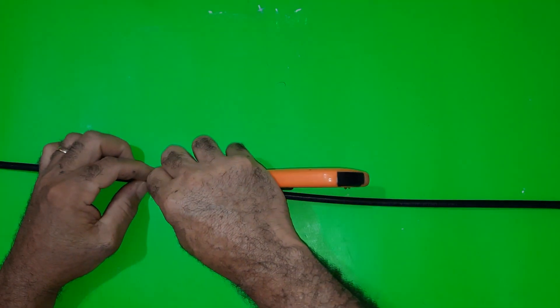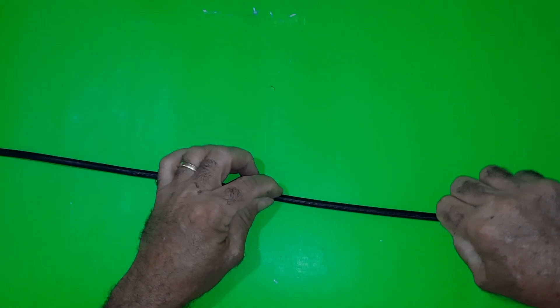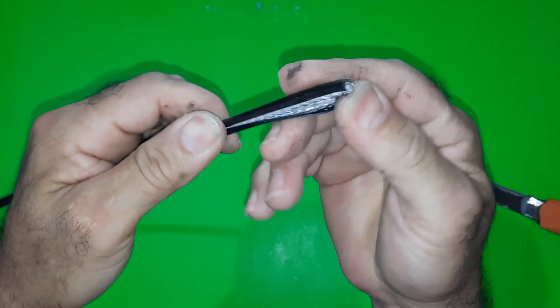The total length of wire necessary for the manufacture is 158 centimeters. The active receiving part of each frame is its top and bottom horizontal parts. It turns out that a two-element loop antenna contains four elements and is equivalent to a double-deck phased array assembled from two-element antennas. The influence of the two additional elements of the second floor is stronger than adding two directors. For this model, it is recommended to use copper wire or a tube with a diameter of two to five millimeters.